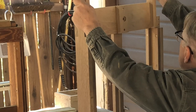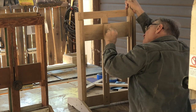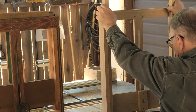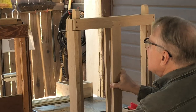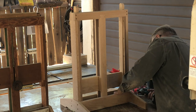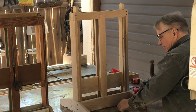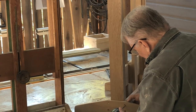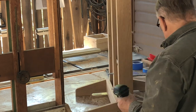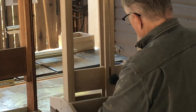I've replaced these two vertical pieces back into the roller stand where they go. I'm using two-and-a-quarter inch screws that will enter in that vertical piece from the inside and seat in the cross members between the feet. We haven't glued this up yet so we're able to remove pieces as needed. I have one whole side off as far as that center vertical piece and the cross member between the feet is concerned, and I can add this sliding mechanism now, reseat the bolt, and then put it all together. Checking once again now to make sure everything still slides easily, without slop, just the way that it should.